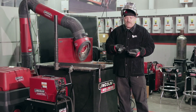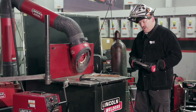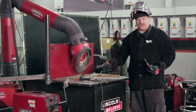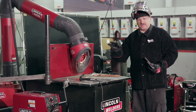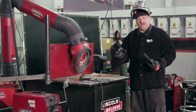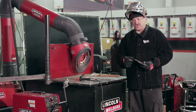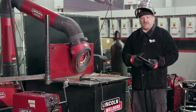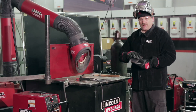We're going to be using a 3/8 thick backup bar today and I've cleaned the mill scale off of that backup bar and off of the 3/8 test plate here too. For the fit-up, there's a number of ways I can fit this up, but I chose to lay out three backup strips of the same thickness and I'm going to lay my plates on top. I'm going to tack from this side so I can see what I've got. Sometimes when you make a tack, things move around a little bit and if that happens I can make some adjustments. I'm going to use 6010 to tack with instead of the 7018 I'm going to take the test with. I'll be tacking outside of the weld so it'll be alright to tack that way. It's easier to tack with 6010 than 7018 if it's allowable per code.